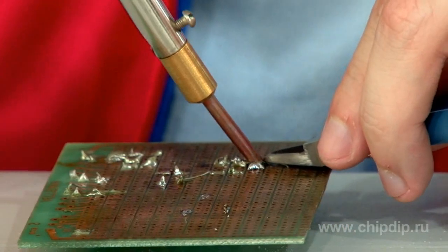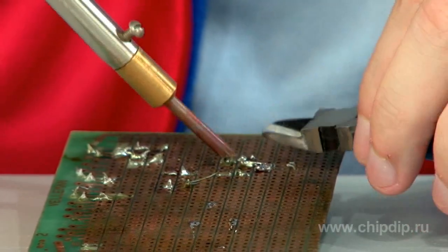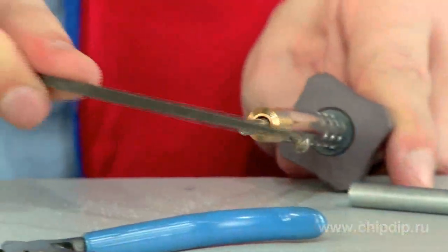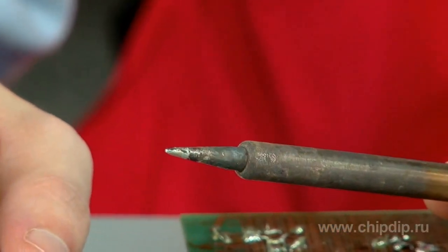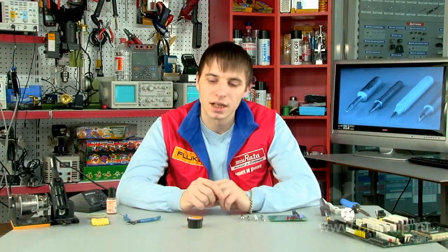In the process of soldering, copper and tin come in contact at high temperatures, and copper diffuses into tin. It also interacts with oxygen in the air. As a result, the soldering bit deteriorates quickly. However, loss of shape is just part of the problem and can be corrected with a file. It is the oxides that create most inconvenience, since it is impossible to properly tin a bit during and after soldering.